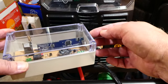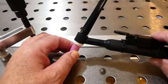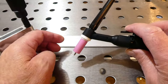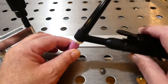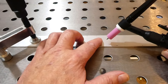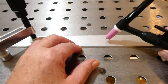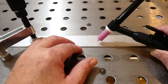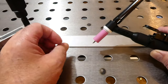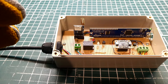You could buy controls that fit onto the torch handle — a little switch that starts the pre-flow and arc, but it does not control amperage; it's full amperage when pressed and no amperage when released. You can also buy little wheels on the handle to control amperage, but when welding you need to maintain a constant distance between the tungsten tip and your work. If you're adjusting wheels as you go, you'll move up and down and get a poor weld. So I'm going to control amperage using my left hand — a controller built into my left-hand glove.